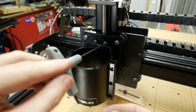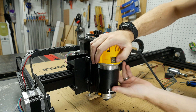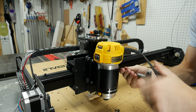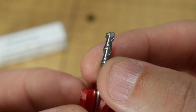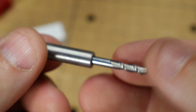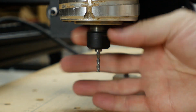For my new spindle, I'm using the Dewalt 611 trim router, and it slides right down into the spindle mount and locks in place. You tighten it in place by adding those three screws back in from the side, and then it's ready to go. To run these test cuts, I used an eighth-inch bit — a two-flute carbide bit made for cutting aluminum. I'll put a link to it in the description. It fit into a sleeve, so it was the right size to fit in the quarter-inch collet of the router.